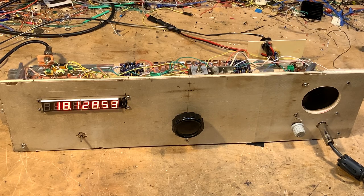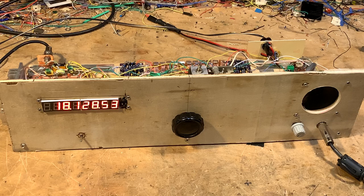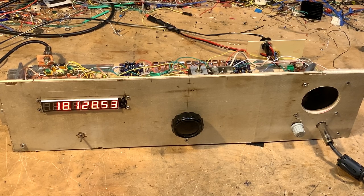And this avoided — for a while there I thought I was going to have to have two different counters in there. But I remembered a feature of the Sanjian frequency counters — little known. Many of you may be using these counters and not realize it. But there's a very simple way you can set up one of these Sanjian frequency counters to switch between two different IF schemes. And that's what I did here, and that avoided the problem of having to put another smoke-producing rectangular hole in the beautiful front panel of this 1712 transceiver.